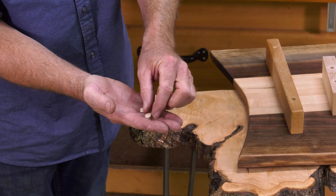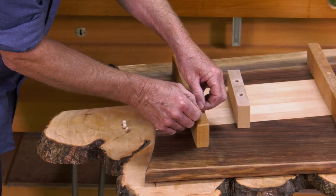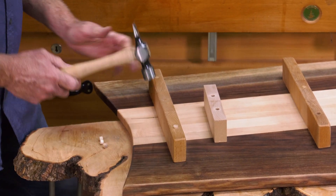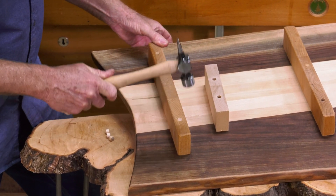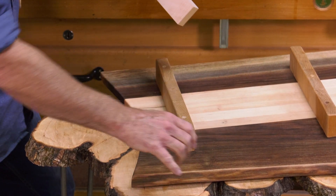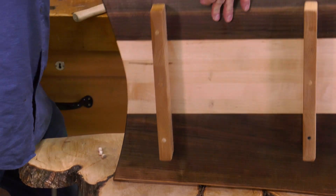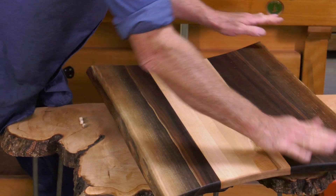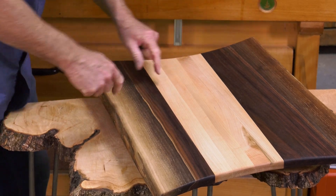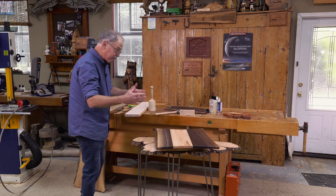See these? These are maple plugs — they're like a mini cork, three-eighths of an inch in diameter. Where I have counter-bored holes that are deeper than countersunk holes, you tap that home and it finishes the edge. These feet are longer, but it's still not cross-grain — the grain is harmonious on the feet and on the glued-up top. That's a cutting board with a hard maple center for cutting and the sides for your foods, your layout. Life's too short to have ugly cutting boards.